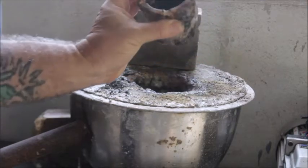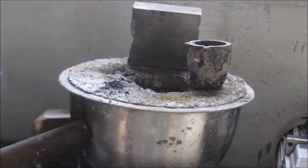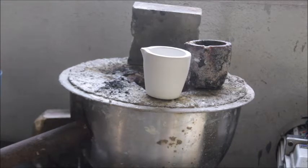I know that might be hard to believe, but look on the inside and it's still clean. The thing about this crucible is it's a ceramic silica crucible — that's what it is, a slip-cast ceramic silica crucible. I came up with a coating that can take insane heat, and I coat my crucibles with it, and it makes them last pretty much forever.